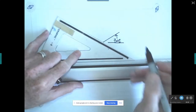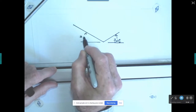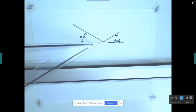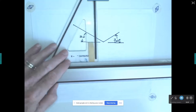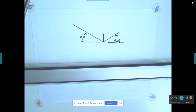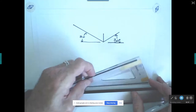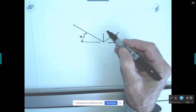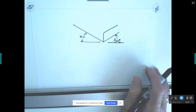I'm going to flip the triangle over and draw another 30-degree line. In isometric drawing, you have two axes, and if the planes you're drawing are normal — not inclined — the angle of the lines in your isometric drawing are going to be at 30 degrees. Any vertical lines you draw are going to go straight up. So right there, you have the corner of an isometric sketch.